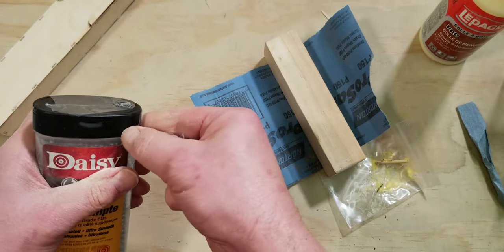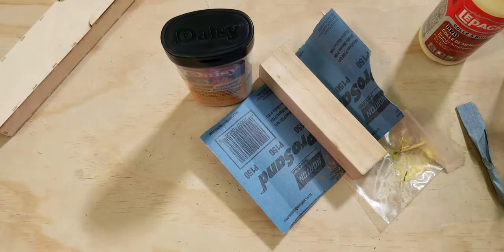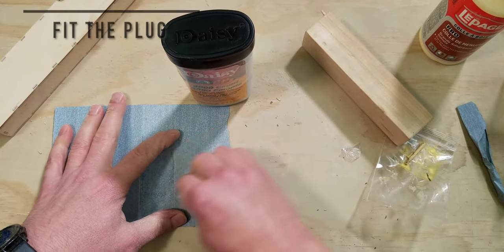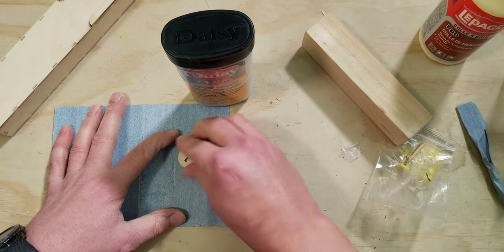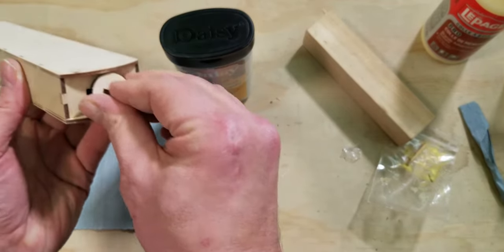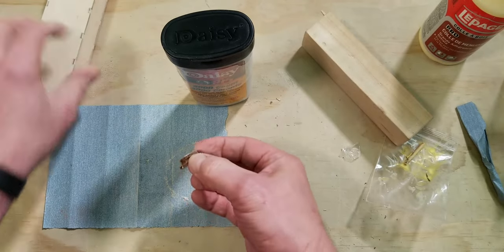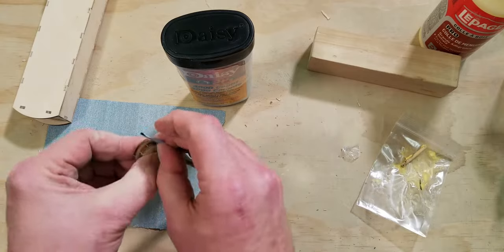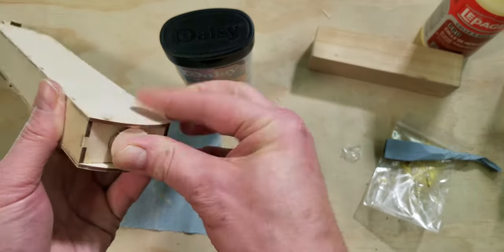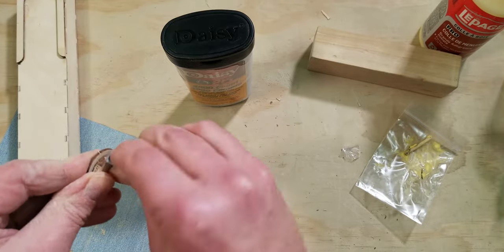If you want to use your own, people have used anything from pennies to fishing weights to car tire balancing weights, pretty much anything that's going to come up to around 3 pounds, 3.5 pounds, anywhere in that range. The actual weight isn't critical. You just want enough to ensure the clock runs, and not too much that there's a huge strain on the axles. If you fill the weights, you don't want to go much under 3 pounds, but once you hit that 3 pound weight, anything over that is unnecessary, or should be unnecessary.